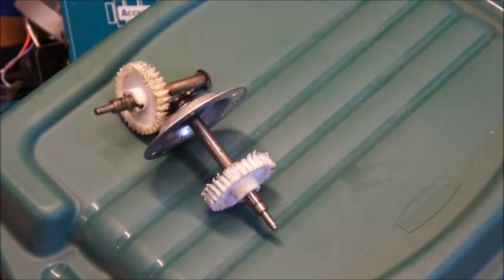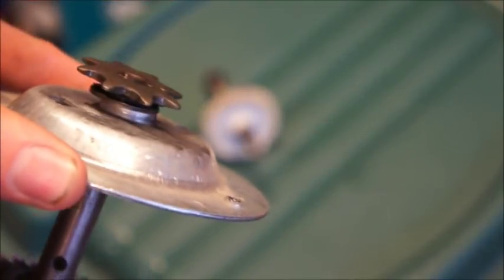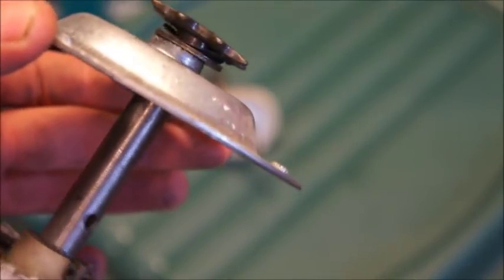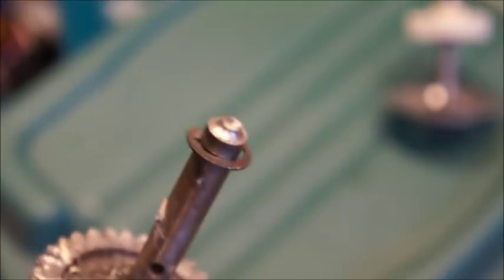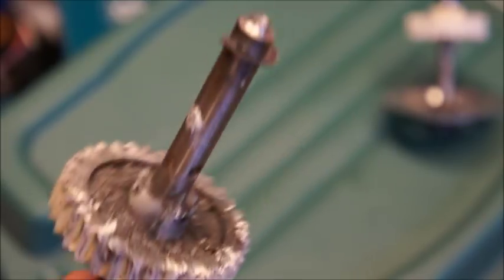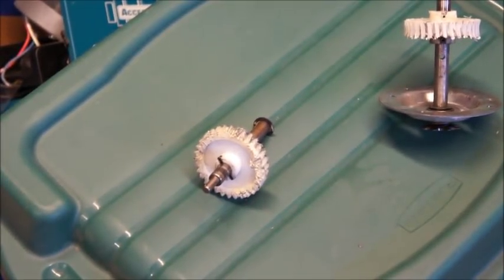There are two other cases. On this bin here, I've got two more examples. This one not only has a stripped gear — that gear is shredded — but the top bearing is also completely destroyed. Signs of this would be a loose chain, a chain that hangs way down below the rail. Or you could have a broken sprocket. If you look down at the top of your machine, all you would see is that little stud at the top. This can happen due to an unbalanced door, a heavy door, or a door with a broken spring, as can the other cases, including the stripped gear.